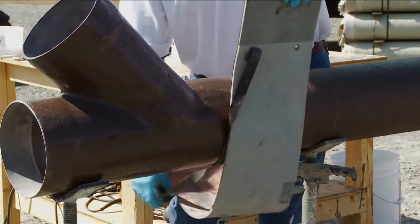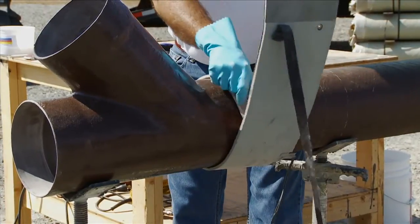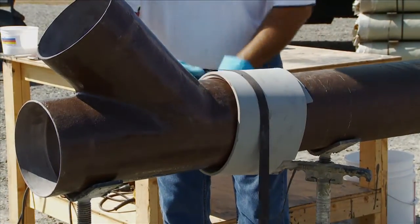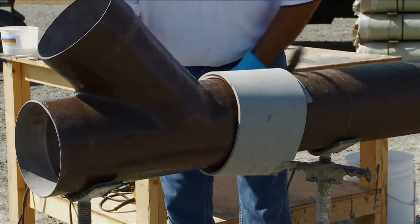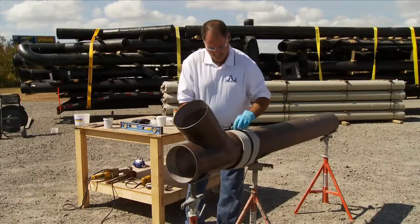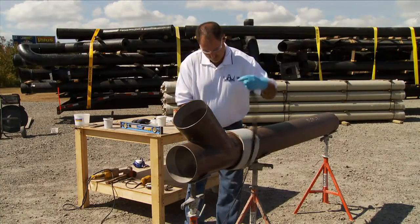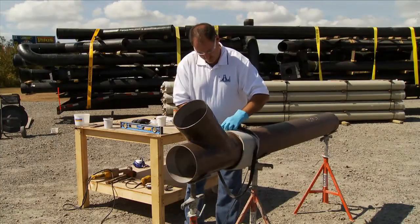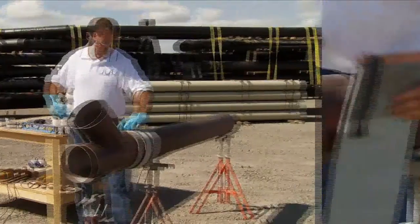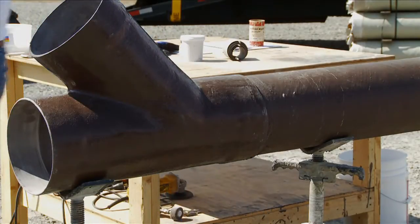By using an electric heating blanket or collar, the curing time can be reduced to about 15 minutes. The electric heat blankets are available in all sizes and attach with snaps or Velcro. It can be difficult to get the heat collar on and aligned without moving the joint, so be certain that the joint is gelled before assembling and using the heat collar. When the joint is fully cured, it's ready for installation.